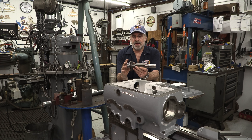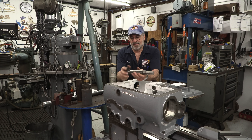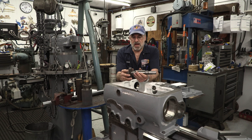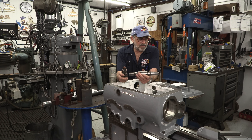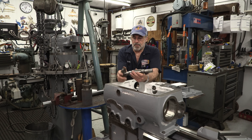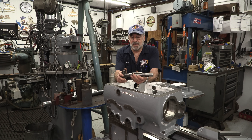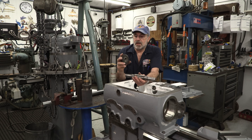With this gear all the way in there, there's no way that this gear is to be considered safe or even close to lasting any duration of time. Because if this doesn't fit on there really nice and snug with a positive fit for the gear to the shaft and tension to those two keys, we'll end up having the same situation. The signs of this lathe — it's almost like a chuck key was left in the chuck, spun around, caught on the ways, sheared off this shaft — and probably all this damage came all at the same time. It's only my observation.